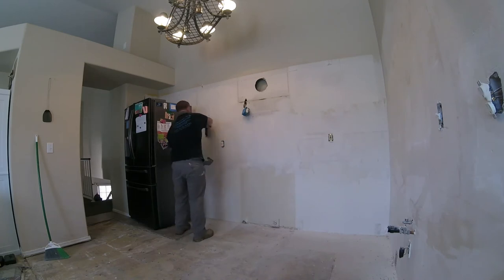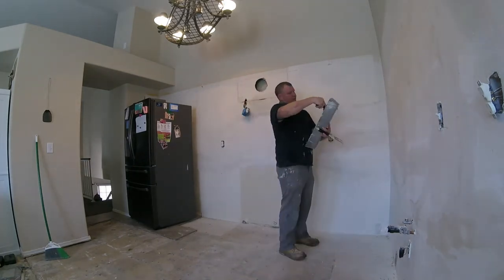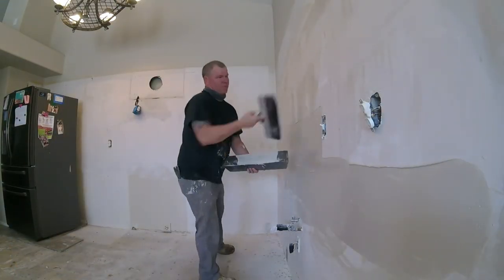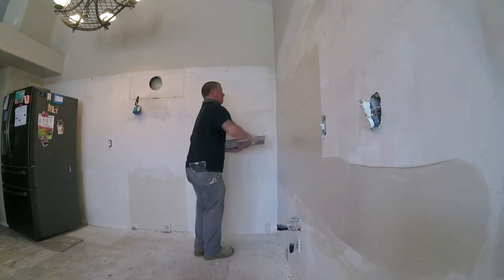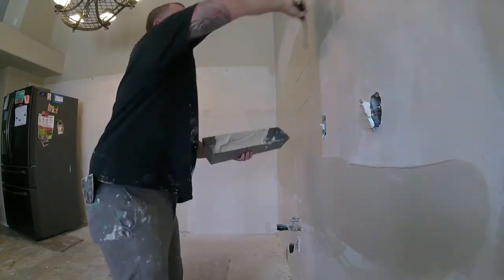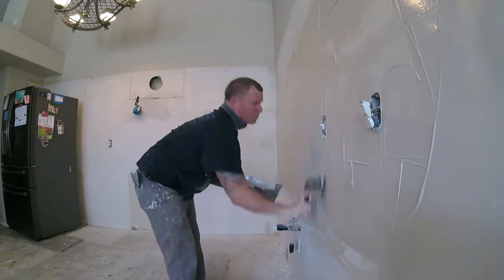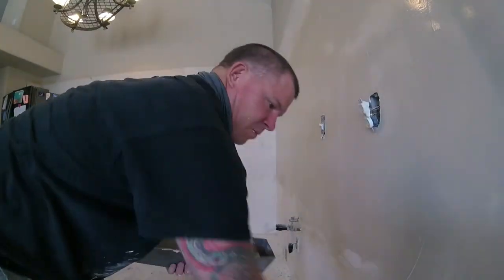Filling in all the deep stuff, any chatters. This area is pretty rough so I'm doing a full coat of 20-minute hot mud over it. If you didn't want to use hot mud you'd just have to second coat it, let it dry, and maybe do a third coat. I'm using hot mud because I don't want to come back — this is my second trip to this job. Now I'm just doing a joint compound coat, going past my first coat and past my touch-up hot mud areas. It's basically a smooth wall finish — not a perfect level-five, but a nice smooth finish.